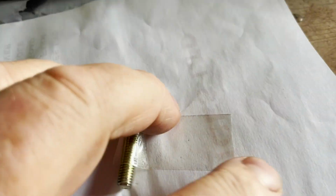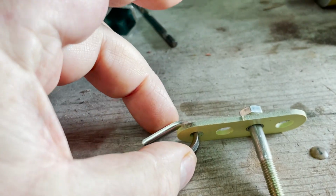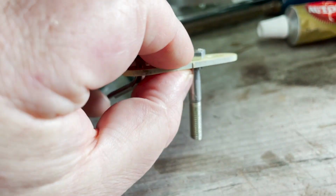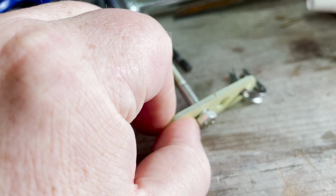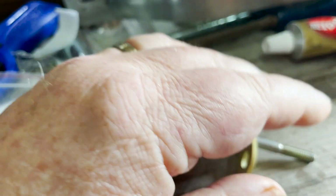Right then, well, we're in the man shed, and we're gonna be fitting this. As I said, I lost it, so I've got a new one. Thank you, Graham from Sprite Aviation. It's just the little shim on there. Right, let's go and put that on. So as you can see, there's the thimble. That's going to be swaged onto the cable. And that's the little shim that goes on here. Okay, little shim that goes on there, and that's to prevent the hole from elongating. That's the reason behind that.